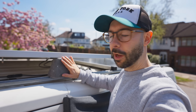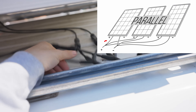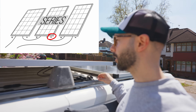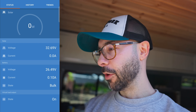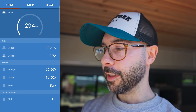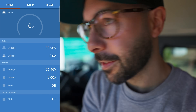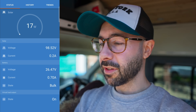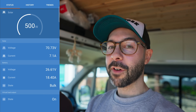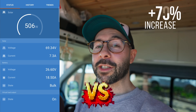We're going to try running our solar panels in series because at the moment they're in parallel and see if that brings us more solar power — if not, Eric, your 20 years of solar experience gave us some bad advice. I've undone the solar panels and lifted them up, held up with a little flower pot. The old way had all the positives going into one single positive and same with all the negatives, but now we're going to daisy chain them: positive to negative to positive to negative, three times. We put it back in parallel first for a fair comparison and we're pulling in just under 300 watts. We switched to series and we're now at 100 volts — it's just tracking to find the most optimum power point. It's brought it all the way up to over 500 watts! I'll give this one to you Eric — you were right.